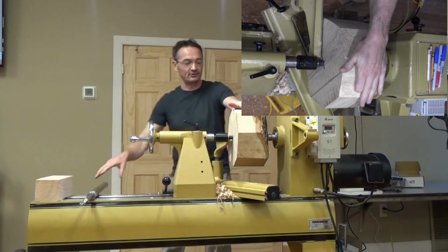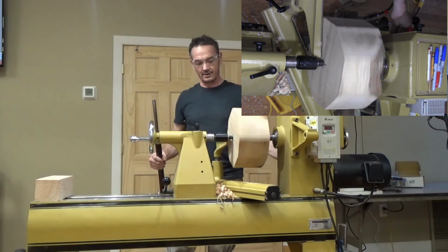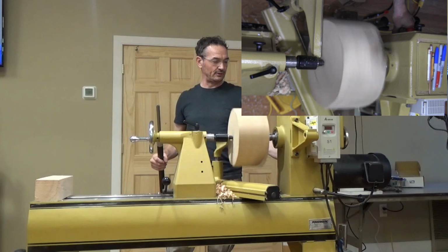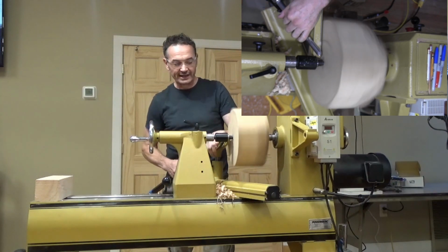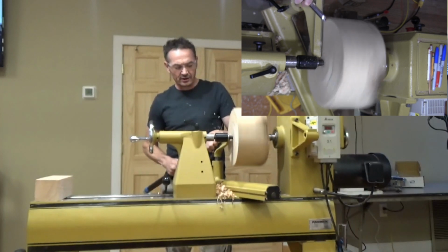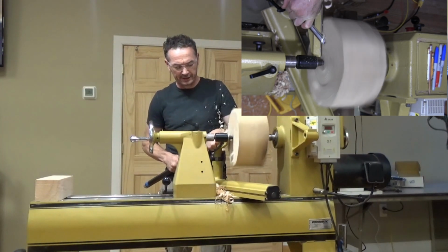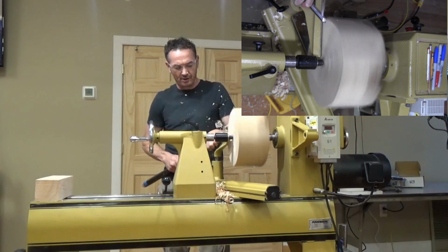Okay, same problem here. So speed down, not too fast, so build it up. Check we're not in balance. So open it up again, about 800-900 revs. There's 900. Just level the face. It's just a peeling cut. Nothing fancy here at all. I keep my left leg forward, so I move my whole body to form the cut, not my arms.